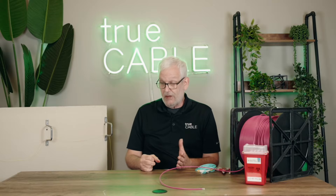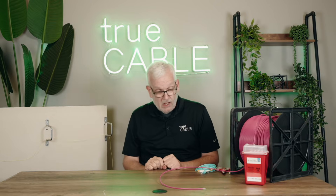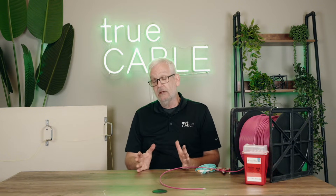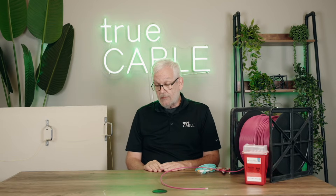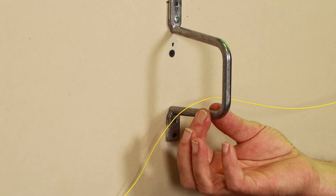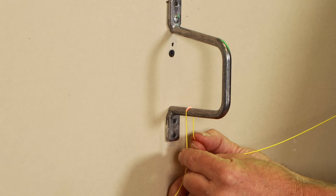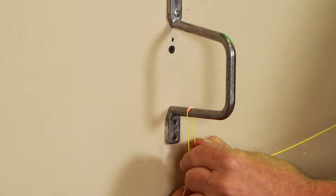Here's one a lot of people aren't really prepared for, especially those new to pulling fiber cable. Don't use discontinuous pathway types such as D-rings, bridle rings, or J-hooks. Even ladder rack and basket tray are not suitable for fiber optic patch cords — unless your fiber is armored. This type of pathway is often impossible to protect from excessive bend radius. You can see from the light escaping the fiber as it's drawn over this post — that light escaping is signal loss.